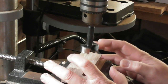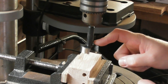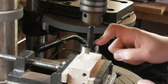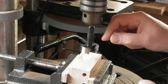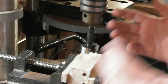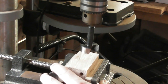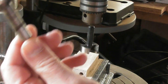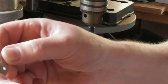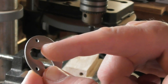So this is just a test piece just to show you what we can do. Now I have got here a 36 millimetre Forstner bit — it's a Bosch drill bit, it is really good I have to say. 36 millimetres isn't the most common of sizes but you can get them. So what I'm going to do is just show this in its simplest form: a 36 millimetre hole, followed by a 25 mil hole, because you need a little bit of space behind the lips there that catch under the crown cap.